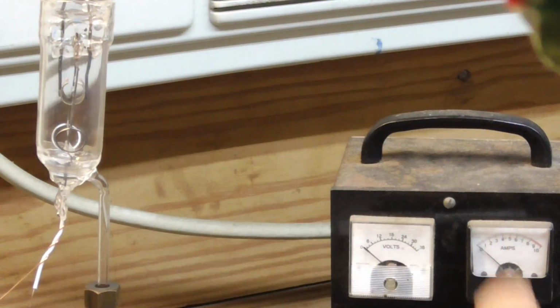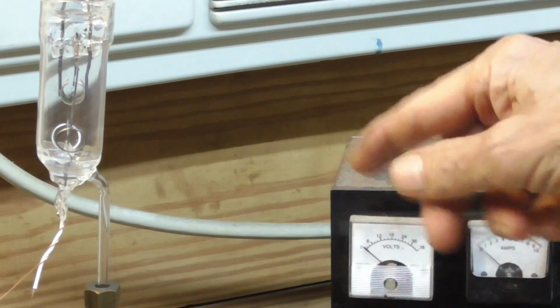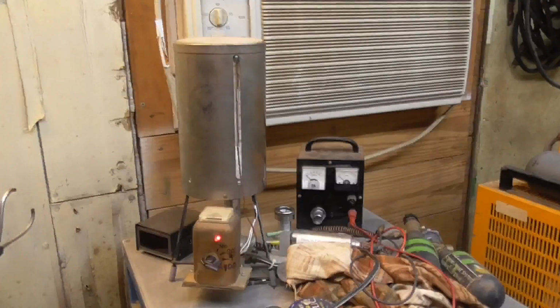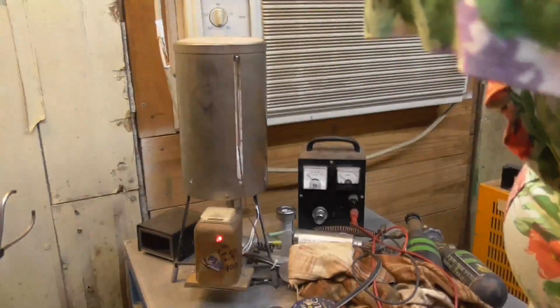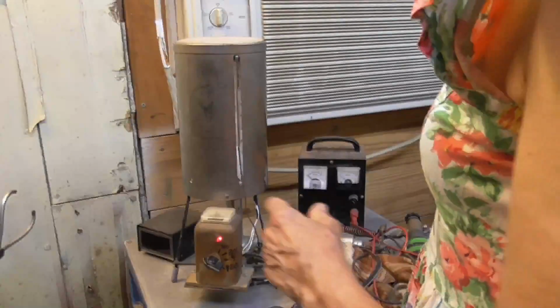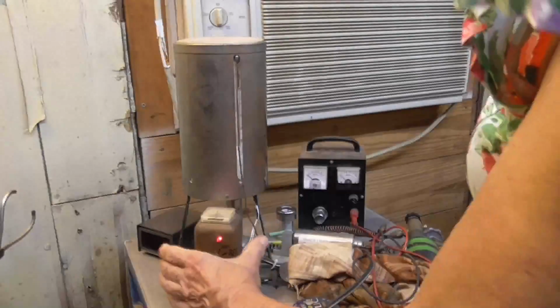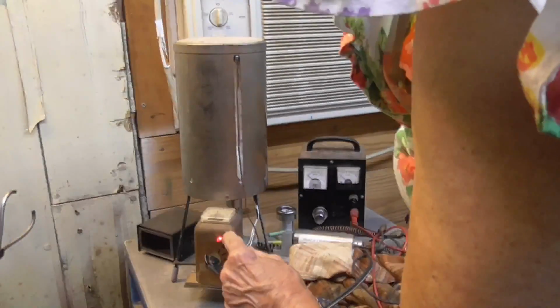What I'm going to do is I'm going to get the oven, and we're going to oven it at about 500 degrees. I can't go too hot because I got a solder joint there. But we can go up to about maybe 400 degrees without melting the solder. Okay? So this oven, we got it set now. I'll have to let it see where it goes to, temperature-wise. There's 400. Okay, it just shut off. It's all homemade stuff. I could get a professional controller. Okay, there's at 400. I don't want to go higher than that.